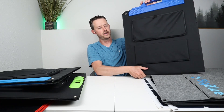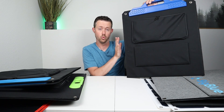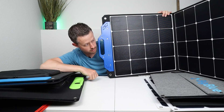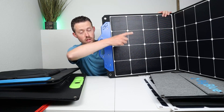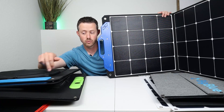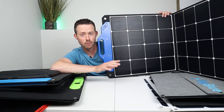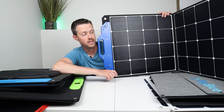The failure of all the panels was the ATEM. It comes in at $200 and put out only 80 watts — the worst performance for the price. It basically looks like the X-TAR SP100, almost like a clone, but they must have gotten second-hand quality SunPower cells because this does not put out nearly as much power. We saw 123 watts on the X-TAR and 80 watts on this one — a 43 watt difference — and this panel is only $50 less than the X-TAR. Don't be fooled by panels that look premium, because they probably won't put out the same amount of power. You usually have to pay for the power.